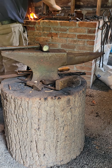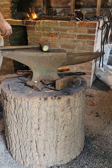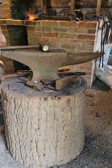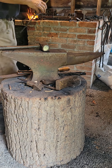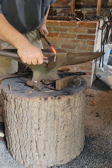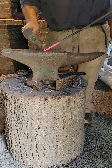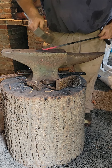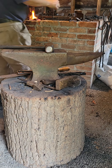Now what I'm going to do is make the small eye. I'm going to do that over the edge of the anvil, over the edge of the face. It's just going to be a glancing blow over the side. You don't want to hit this too hard — you're really not trying to change the shape of the stock, you're just trying to move it. So I'll have that nice and hot and just do light glancing blows over the end, then come over with the hammer, moving the stock and the face of the hammer a little, and bring them over until they just touch. I'm going to put that back in the fire with that little eye facing up so you're less likely to burn it.